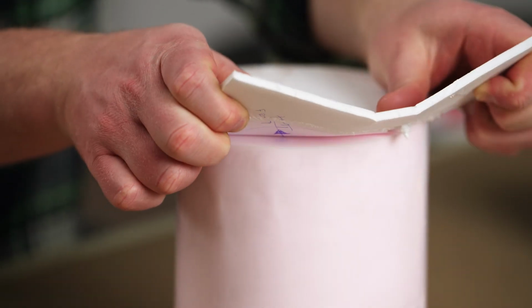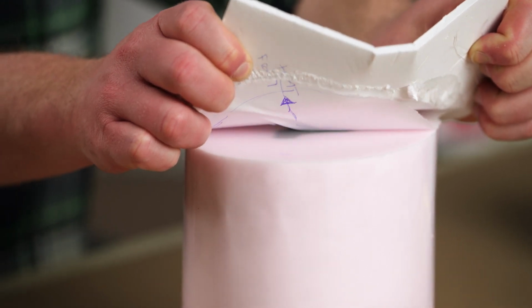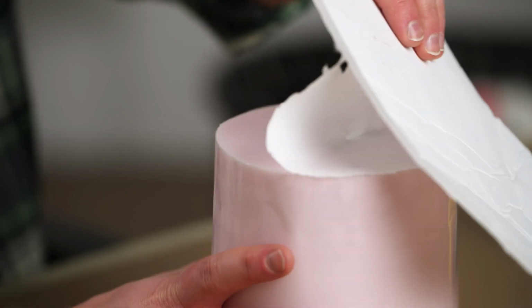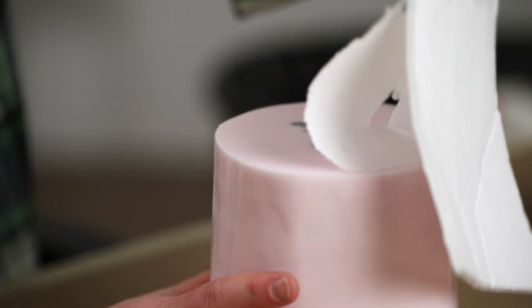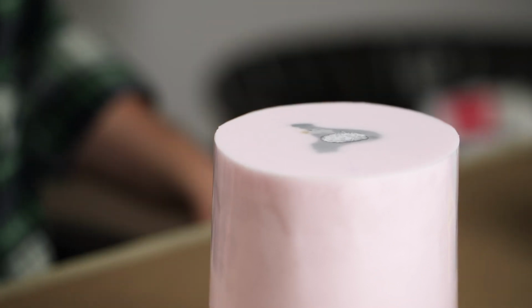If we used another, less intense way of adhering our master, such as hot glue, then we know that applying a slight amount of force will most likely unstick our base. When we go to remove our base in this case, we'll take our time and apply steady pressure without aggressive actions. A steady pressure will release the glue and allow our base to come right off.